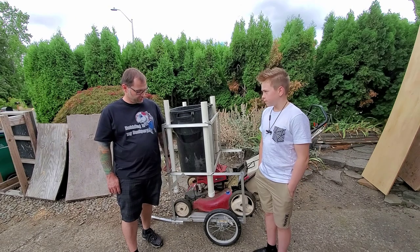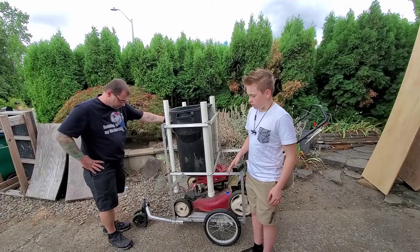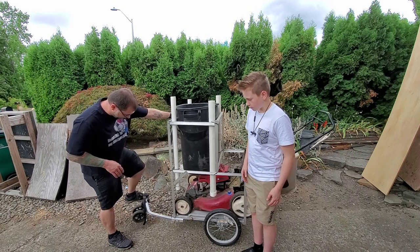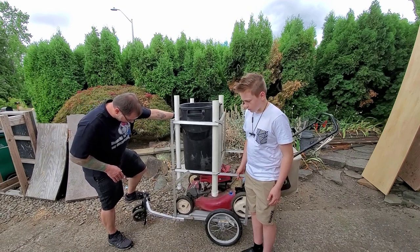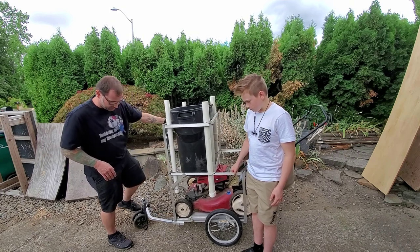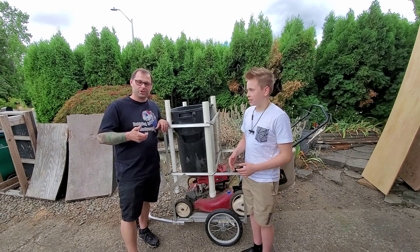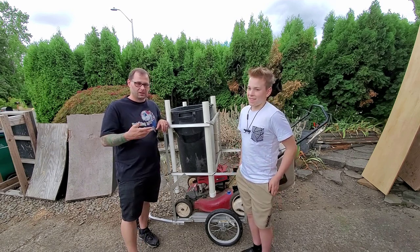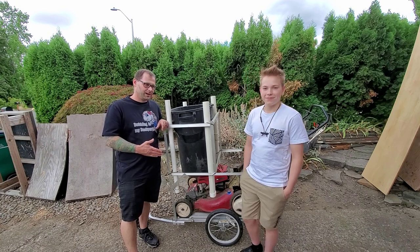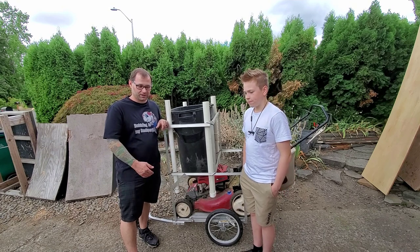What's the con to this trailer build? Is that it's been pulling the tire off of my bike. That has to do with the weight that he's hauling and the fact that this is on his back tire. And as he's pedaling and it does this, it loosens itself up. So if he doesn't pay attention to the fact that that tire is loosening, which he should be checking like once every time that he hooks up the trailer, but he doesn't. And so what happens is that the tire breaks free and it starts getting loose on him and can even kick sideways and cause some hangups.